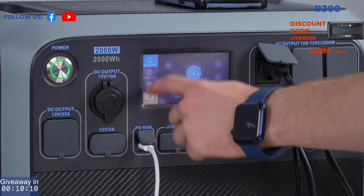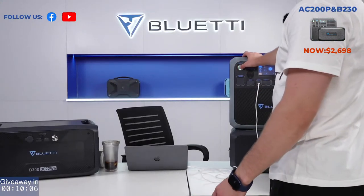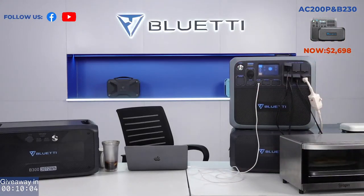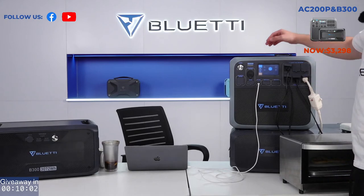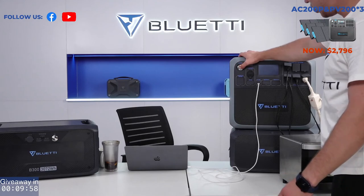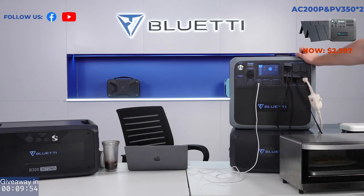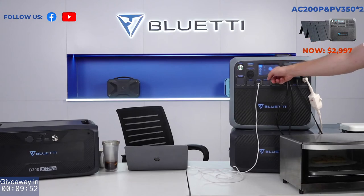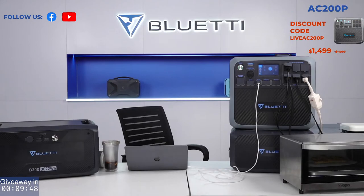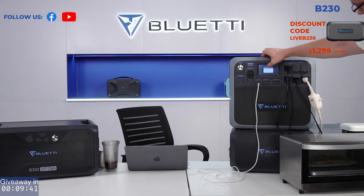Now you have an alarm. This is how you see that you have an overload. In this case, you would just want to turn off and restart, and you'll be just fine. Nothing bad happened. It's showing you that, oops, you might be pushing it too hard. So just turn on and off again, and you're good to go. So AC on, everything's okay. And DC on, of course, because we're charging a phone right now from this wireless charging pad, and these wireless charging pads are DC.